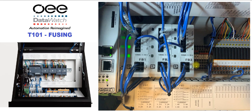There are these sections of contact blocks throughout the panel, and they're labeled. This one is being powered by fuse block 2/2. Then you have commons you can use. The first fuse block is on all the time. These inputs are tied directly to the 24-volt DC. These 2 are for outputs. They are switched on when you have a valid reset of the e-stop circuit.